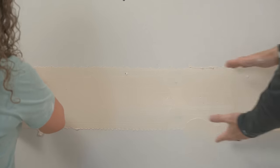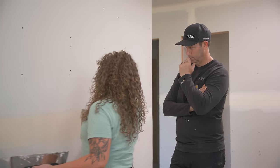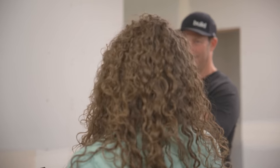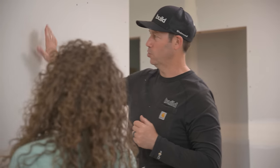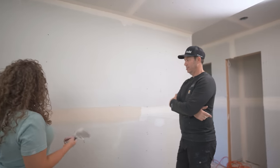I'm telling you, I'm seeing already that you're very smooth on that. I'm going to cut my — oh, there's a messed up screw there. Proud screw. And then I'm going to take my knife and run it nice and flat down, then clean it up some more. So as you can tell, it's a little overfilled, honestly. Oh my gosh, you're so much faster than what I just did. And then for the screws, we're going to take our knife and instead of doing single ones — you did all three of those all in one swipe. Yep. And then you're going to go ahead and bring it down. I'm noticing you're only trying to fill the nail head rather than mine that had kind of a patch of drywall. Yeah, that's really important — really all you want to be doing is filling the nail head.